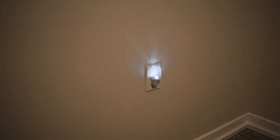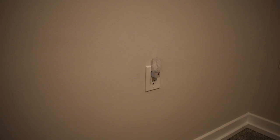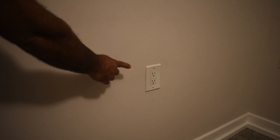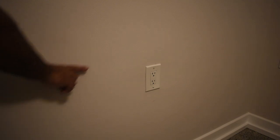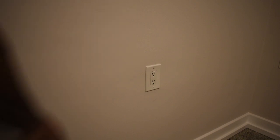Testing it out: regardless of switch position, the bottom outlet is on all the time. When I turn the switch on, the top outlet becomes live — and off when the switch turns off. Very simple. If I didn't have a hot wire available at this location, I would have inserted another conductor of the same gauge (14 gauge) into the conduit between the receptacle and the switch. If there was no constant hot at the wall switch, I'd go around to the next electrical receptacle to find one and insert the conductor from there. Hope you enjoyed the video — rate thumbs up and share!